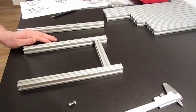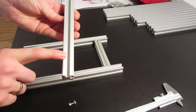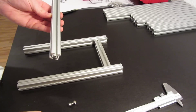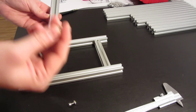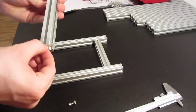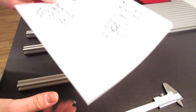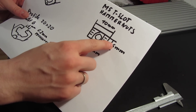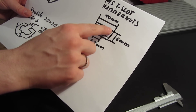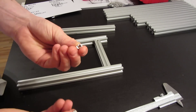I have all of these aluminum extrusion profiles 20x20 with an I-type slot 5. The thing with those profiles is that those T-slot M5 hammer nuts from Banggood won't fit into these type of profiles. As you can see, those nuts are 10mm wide, 6mm wide and 6.2mm on top, in this geometry on top where you screw the screw in.